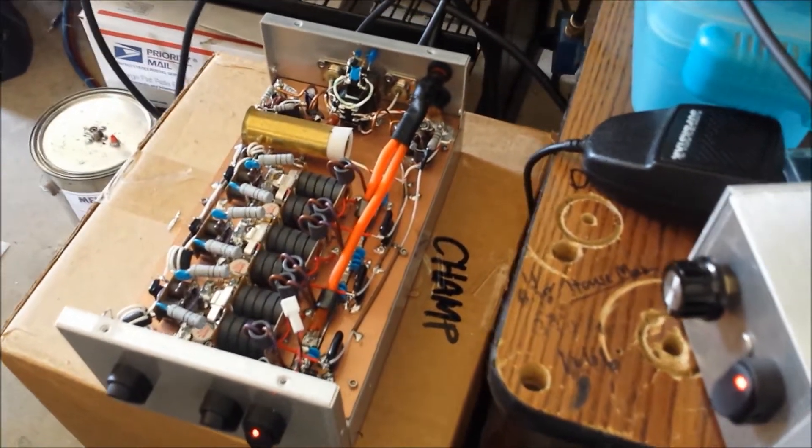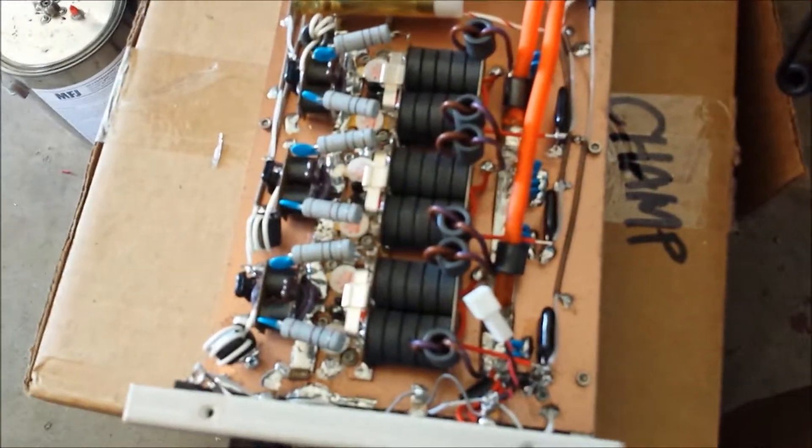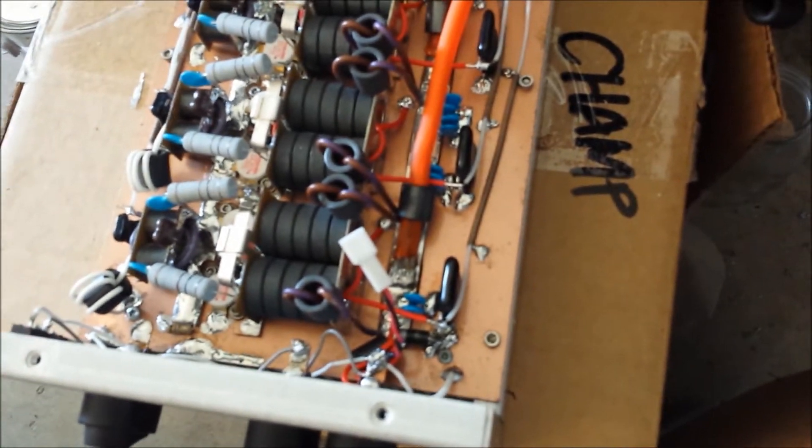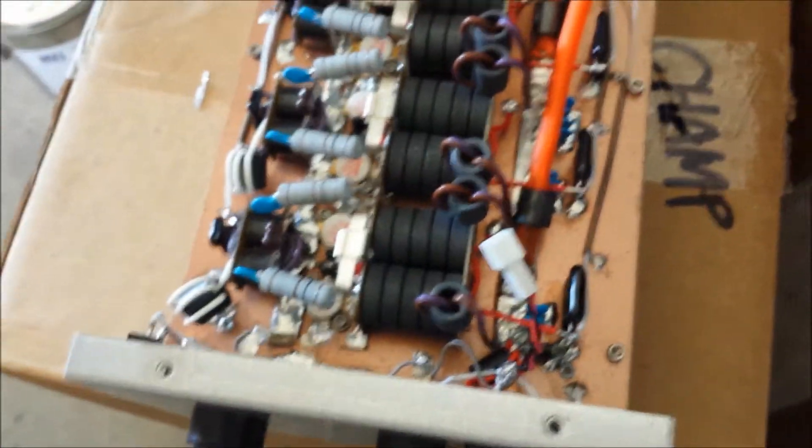What we got going on here is a straight six, built very strong. Using 1000-volt 150s on the output. Utilized a 5.8 core by the guy's request, 5-watt feedback circuit, decent-sized 180s. Your basic conventional fat-boy slash-style combination, if you wish. Equipped with a preamp — a Gatekeeper design preamp.